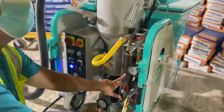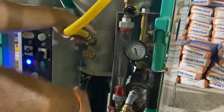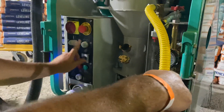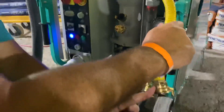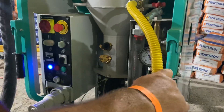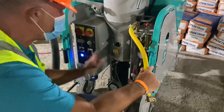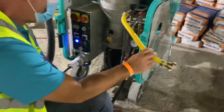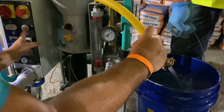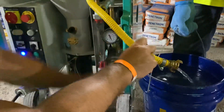We set this to 1200 — this is your adjustment for your pressure level. To check your pressure, take this off and hold it separately; this is your pump switch. When you press it, you'll get water pressure out of here and you'll see where you're sitting on the gauge. Bring the five-gallon pail back. When you hit it, watch — see it running at 1200? So you know your water coming in is good.